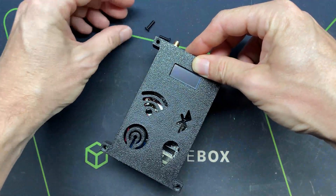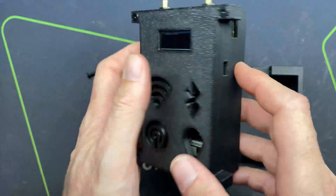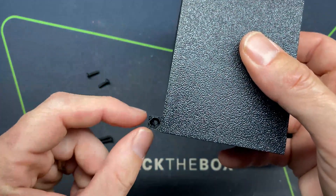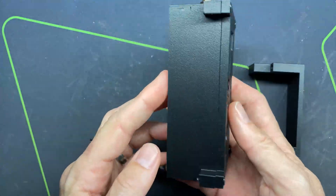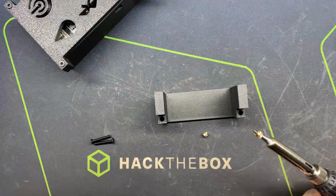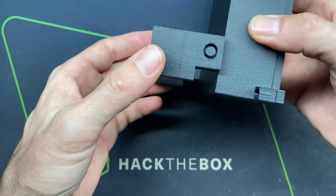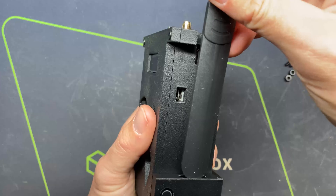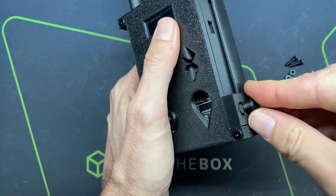Now we can slam the whole thing together and start with two of the M3 bolts on the top. To finish assembling the bottom we have two options: use the short screws and nuts to run it without the antenna holder — the nut outline is already drawn into the 3D print, so just drop the nut in and run the screws through from the front. Or, if we want the antenna holder, we sink in the remaining two M3 inserts, remove the screw and nut from the bottom, slide the holster on from the back, and use the two longer bolts. Then we can holster the antennas and use the antenna plugs — and notice the antennas fit inside the circles on the holster.